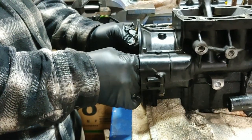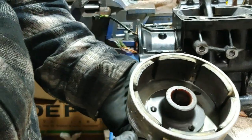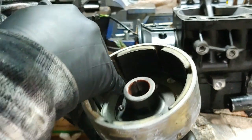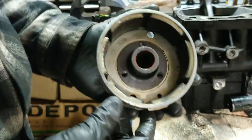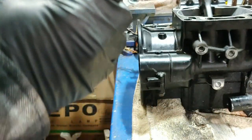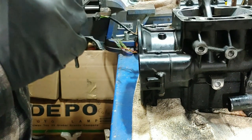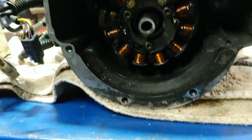Let's pull this guy right off. Yeah - six mag. And there's a little bit of stuff in there for sure - I don't know if you can see it - some stuff back there. It's just chips of magnets is really what it is. All right, there's the stator. So I'm going to pop the stator off, turn it around, and then pop the PTO bearing plate off and then we're just going to flip it.